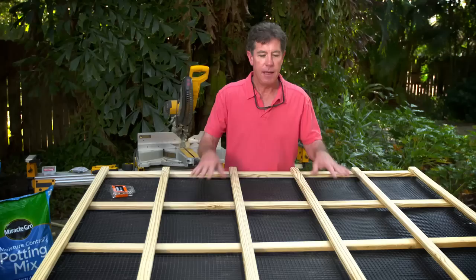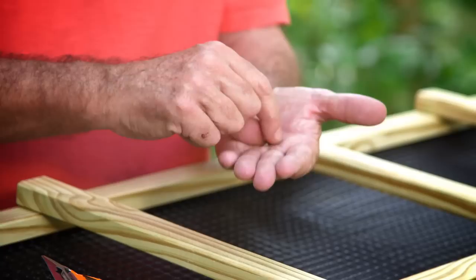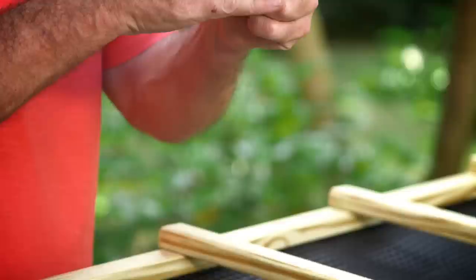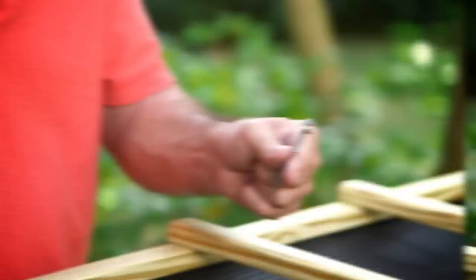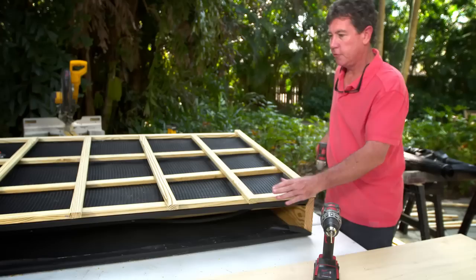So what I'm going to do is come in, tack in the corners, and screw those down. Another little thing that we decided to use on this were these little grommets — the screw goes through it and you drive this in. It flares out the pressure so you don't wind up splitting your board. Look at that — tight as all get out. We'll get our corners good and then we can mess with the center as we go. Got our corners tacked down so now I'm going to readjust all these and go around and knock this out.